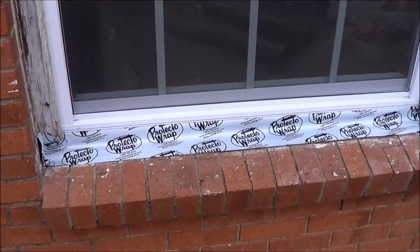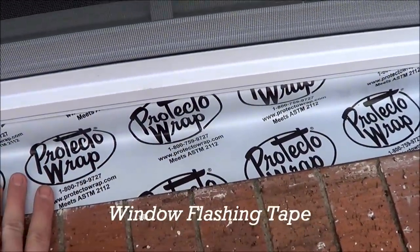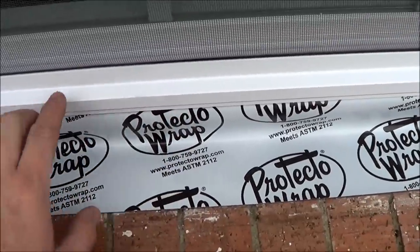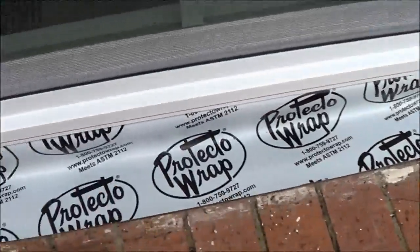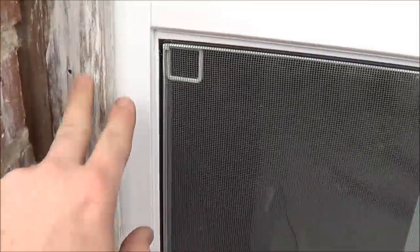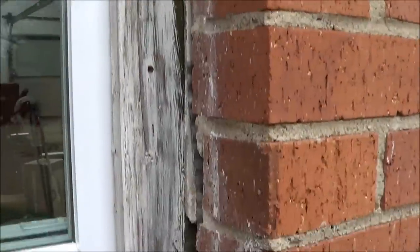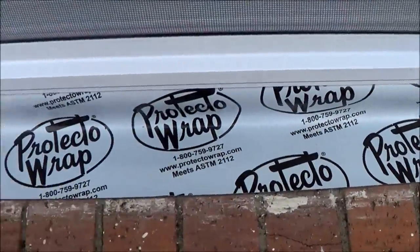Here's the outside of the window we put in. I wrapped some window tape around here to cover up the gap between the brick and the wall. This is set under the window — put some caulk on top of that, then set the window on some caulking and it should be good. We're going to trim this all out and it'll all be covered once we get our trim on. We got our wood all cleaned up and the paint cleaned off. Our top piece is painted — no more rust — and now we just have to do the exterior and interior trim work.